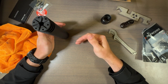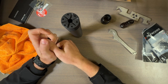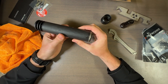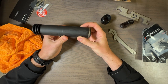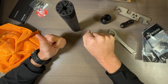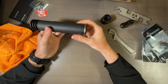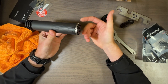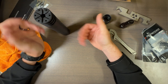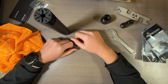If you don't know a direct impingement system — your typical AR — you have your gas tube. You have your gas port in the barrel, your gas block, and that shoots the gas up into the gas tube and back into your receiver. There's also gas that gets pushed back from any suppressors. With a piston, yes there's still a gas port and a gas block, however there's no gas tube — it's a piston rod that gets pushed back, so no gas is going back into the receiver. I want to see how much that has to do with how much gas gets kicked back from different suppressors. I've seen with my Huxworks that gas still gets blown back — you can tell when you pull out the magazine how much gas is being blown back into the upper receiver because you see the gas build up on the ammo.